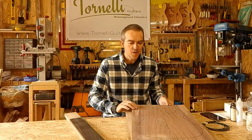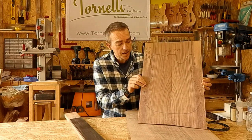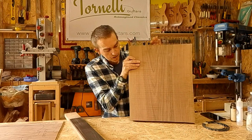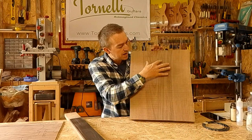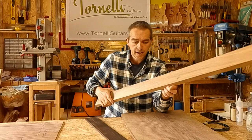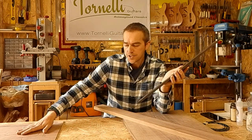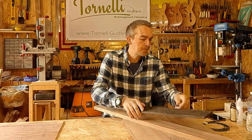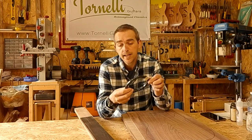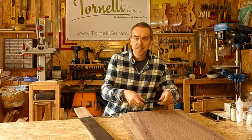I've got a really stunning walnut top that's going to darken up and the grain is going to explode when I finish it. Then I've got a hell of a chunk of dark walnut for the back — rough planed but with a nice grain running through it, so the back is going to be pretty too. A single piece walnut neck and a Gabon ebony fretboard, because I don't want to take any attention away from the top. My single cut design is also a double binding guitar, so I'm thinking a pearl black double binding.